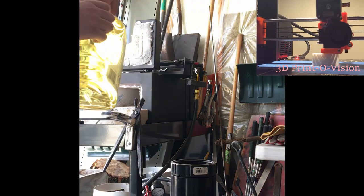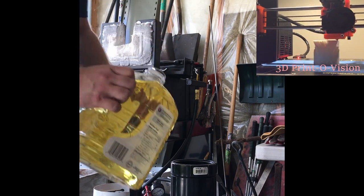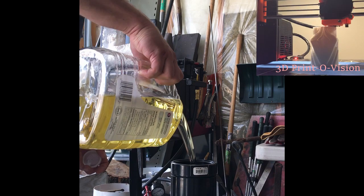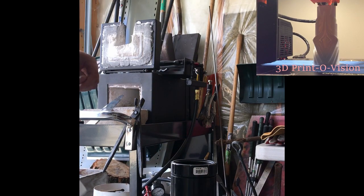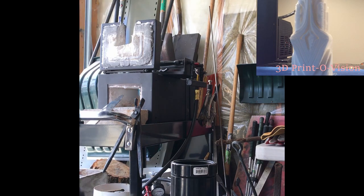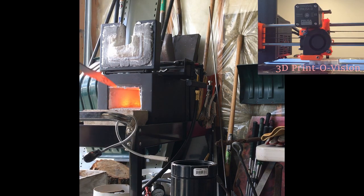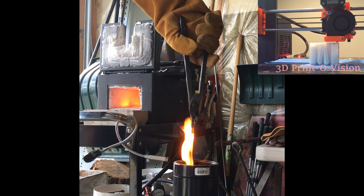And it was time to do some quenching. For the quenching, I used regular canola oil. For the 3D print up top, it took probably about 100 hours of printing. After getting the spear up to temperature, I made sure it was no longer magnetic, which means it was time to quench.